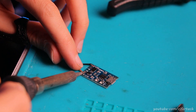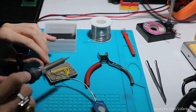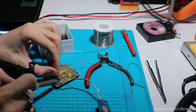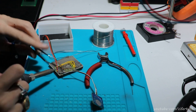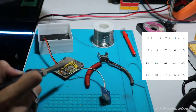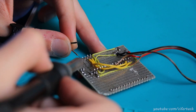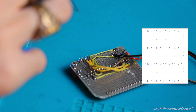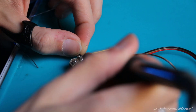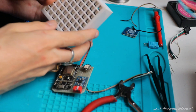After some soldering, I started coding and testing my matrix. There is a little tip about matrix displays: the arrangement of NeoPixels comes in two types. The first type is continuous, where the pixels are connected together sequentially. In the second type, called zigzag, the next line of NeoPixels is reversed from the previous line. Whether you're using continuous or zigzag, you must define it in your code — don't forget, because it will ruin your animation if you don't define it correctly.